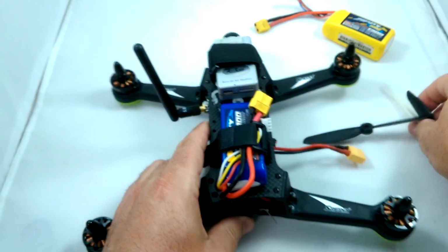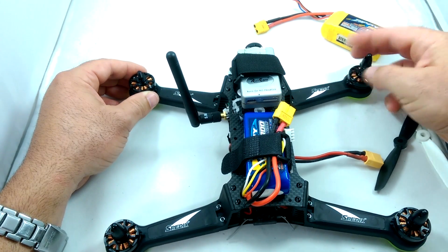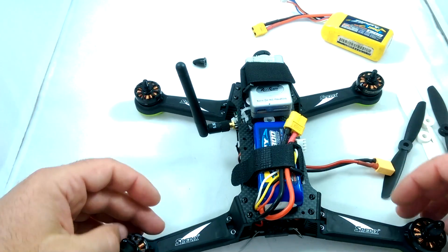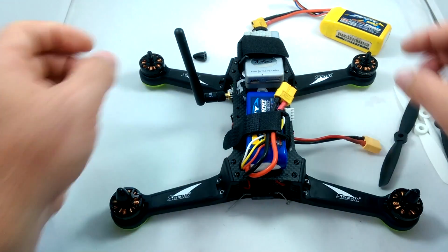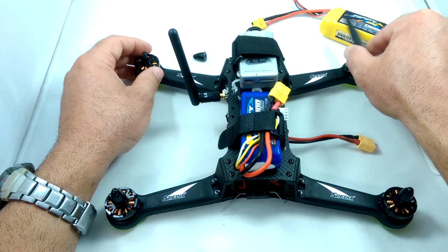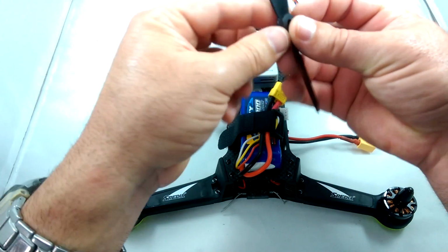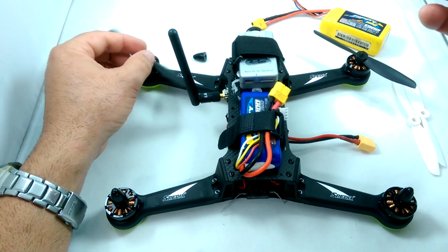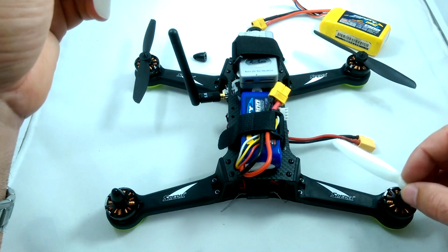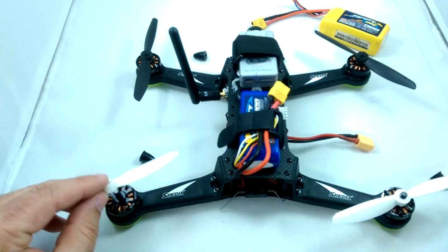And then we're going to go ahead and put the propellers on, and that's basically all we have left to do before we fly. Okay, so just kind of remembering the way our motors are rotating. So just remember that they're rotating in towards the front. So this would be going in towards the front, and these would be rotating in towards the back. And when we're putting on our props, pretty easy thing to remember is just make sure that the top edge is going to be going in the direction like so. So that one would go there, and then obviously the two blacks are going to go in the front, but just to double check, top edge is going to be rotating into the front like that, and then the two rears would be the opposite. Basically rotating the top edge is rotating into the back like that, and same for the other one.